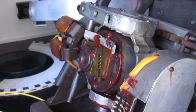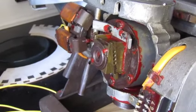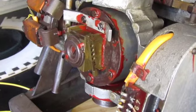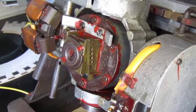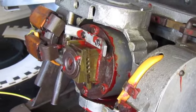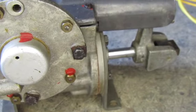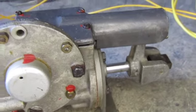If I now zoom in on the gyroscope you will see it will have moved a little bit off-center. I now flick the switch on the clockwork from right to left and you will see it's starting to move slightly to the other side. I flick it back again and the gyroscope slowly wanders over to the other side. Now I can see this effect also on the rudder servo — now it's on one side, I flick the switch and you can see it slowly pushes the rudder which steers the V1 on its new course.